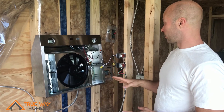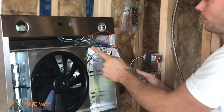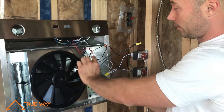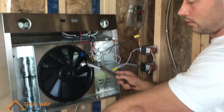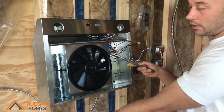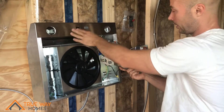The first thing I did was figure out where the wires were going. I had to get a new switch — I needed a double pole toggle switch. I brought the power in, and if I put it on low, the power goes to one side, turns the motor on, and the other wire opens the damper. When it's in the middle and the motor is off, the damper shuts. Once I figured out all the wiring and realized I needed a double pole toggle switch, it was pretty simple after that — I just had to fit the pieces in and put the transformers in.